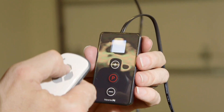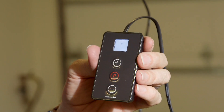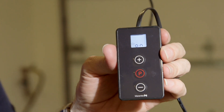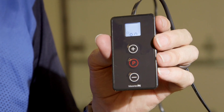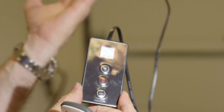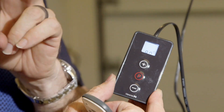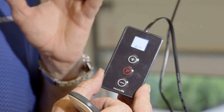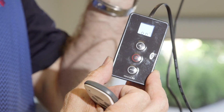We take the transmitter and push the button. You push P one more time, and the programming is done. Most importantly, we now let the operator open and close the door twice. During these two cycles, the garage door opener is able to profile the door and learn the appropriate amount of force necessary to move the door safely.